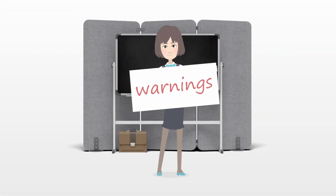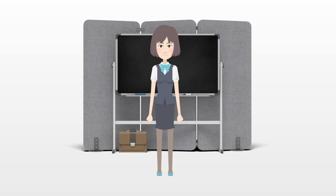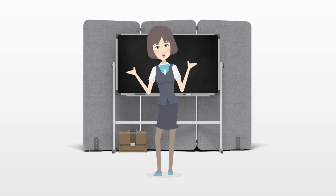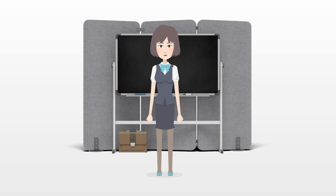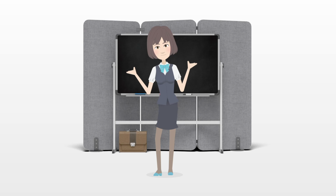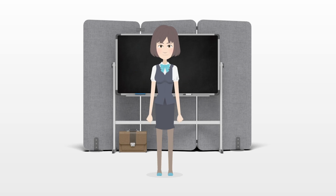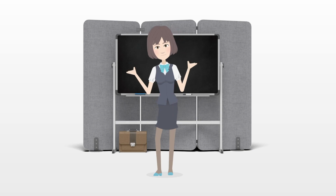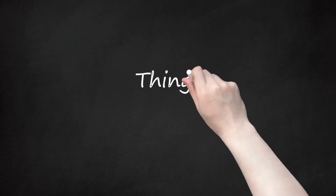Warnings. If you are refurbishing an existing wooden door that was painted with an oil-based enamel, you may find that it is difficult to stain after stripping the old paint. It may be easier to use a faux wood pattern of painting to create the look you want in this situation.